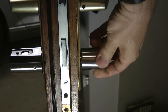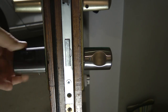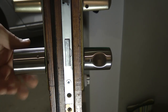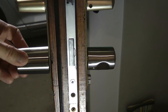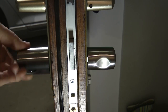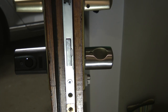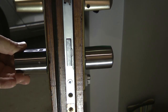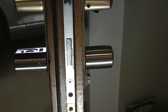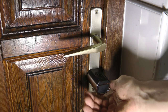The inside knob is always engaged with the lock body, so you can always lock or unlock the door from inside. The outside unit spins freely, and when you scan your fingerprint or RFID tag and it's accepted, a small servo inside locks the outer cylinder so you can turn it. After about 10 seconds it disengages again and the cylinder spins freely.